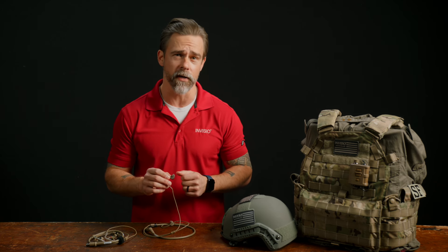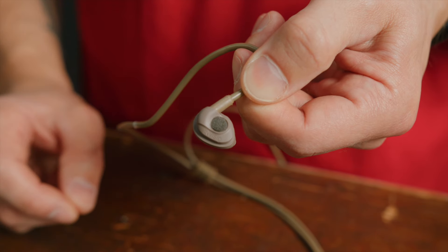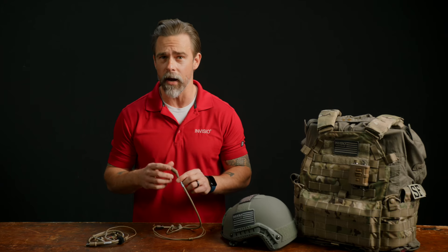The hear-through mics on the side of the headset have been upgraded for better performance and a lower noise floor. The result being you'll have a better rendering of high frequency noise with lower constant background noise, and you'll still have the best situational awareness on the market. The foam windshields are also a little smaller and have been slightly recessed into the earpiece housing, protecting them more and minimizing the risk of them coming off in all environments. We've also shortened the cable length from 1200mm to 900mm. This decision was made after careful consideration of user feedback, along with angling the headset connector to make the overall footprint on the chest smaller, making cable routing much tighter and cleaner. We still have the clip on the cable to connect it to MOLLE and other surfaces, as well as the cable adjustment slider, so you can always find that position that allows you to move your head in all directions without pulling or snagging.